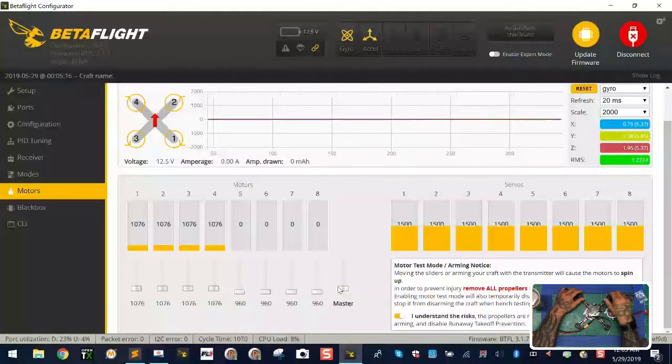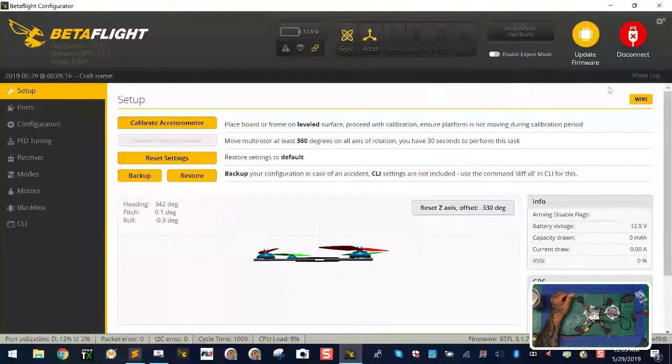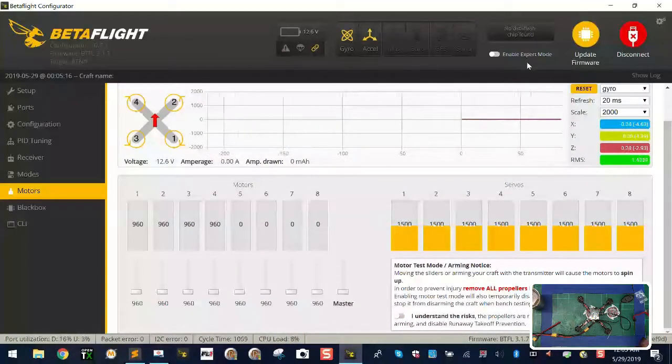Motor 1 is clockwise, Motor 4 is clockwise, Motor 2 is counterclockwise, Motor 3 is counterclockwise. It looks like this quad is now ready to fly. I'm just checking to make sure orientation is right — I'll go to Motors, click Stop, and there you go. So Michael, the biggest problem was that the motors were spinning the wrong direction, and I've gone ahead and corrected the direction in Betaflight. If you have any other questions, hit me up. I'm going to put some props on and give it a test run, but I'd safely say that's what caused the problem. Thanks for tuning in everyone — I appreciate your support, hope this helps, talk to you soon!